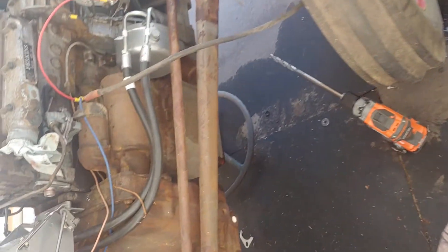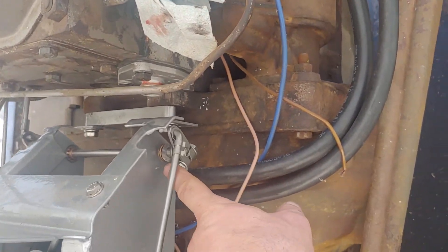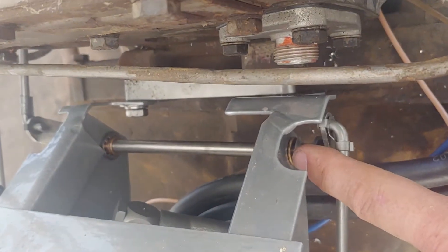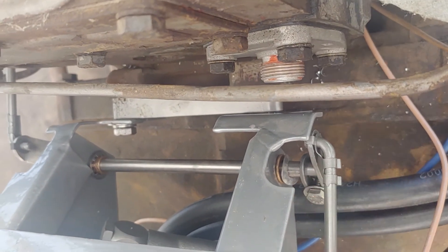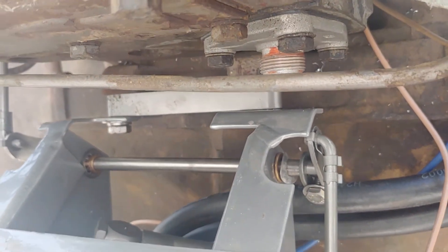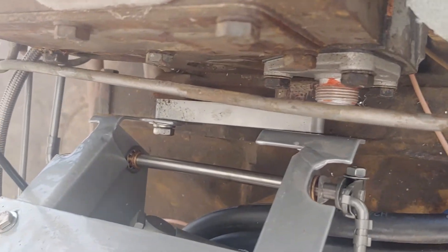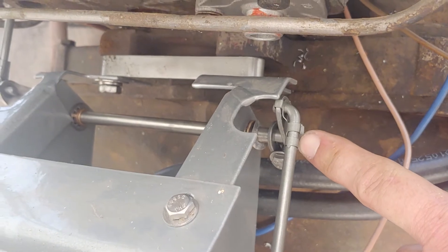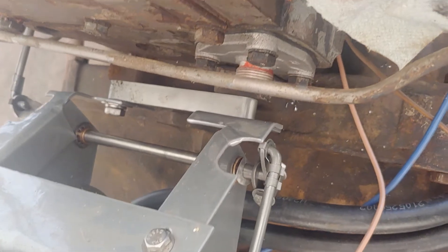Come over here to the tractor and you can see where it went through the battery tray. I put some brass bushings in there — I drilled them out to a half inch and got a half-inch OD by 3/8 ID, about three-eighths of an inch long, flanged bushing. I put one on each side and that tightened it up really nice — everything is nice and tight, no slack at all. I got the original clips back on to hold it together and it's nice and smooth, no binding.